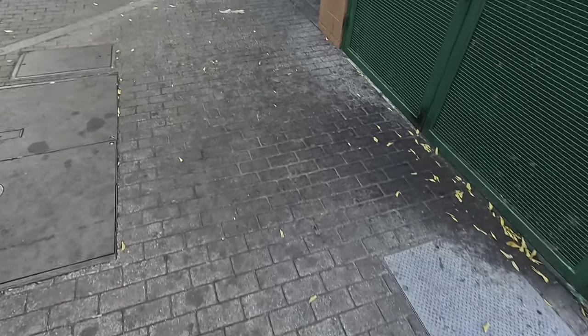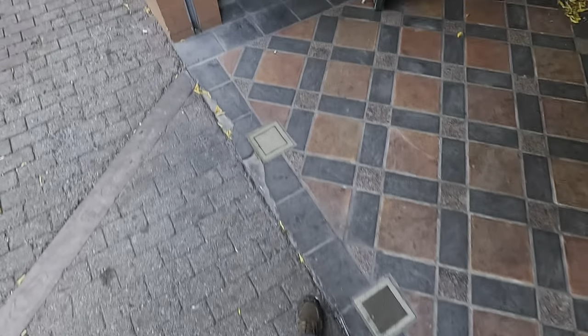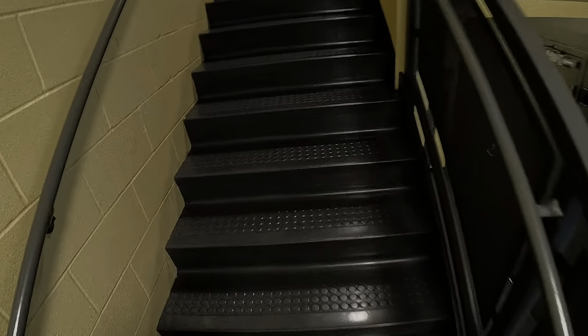purge. They're cleaning up all the leaves out here. They're doing a good job. They're killing it. We're going to purge nitro, braze up our joints, pressure test, and then we'll be ready to pull a vacuum.